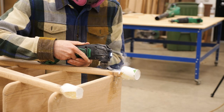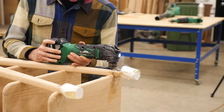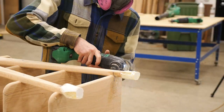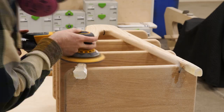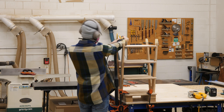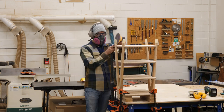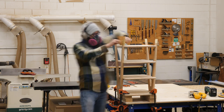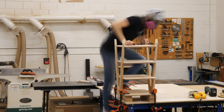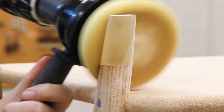I really thought this was going to take forever, but it turned out to be not that bad. I just used the multi-tool to hack away the bulk of the epoxy — probably only about three minutes per foot. After I had it roughly shaped, I got some aggressive sandpaper and worked my way around to refine the shape and create that cylindrical extension of the foot. Once I was happy with the shape on each foot, I went through the grits of sandpaper working my way up as high as I had, then put some polish on to help get the epoxy as smooth as I could.